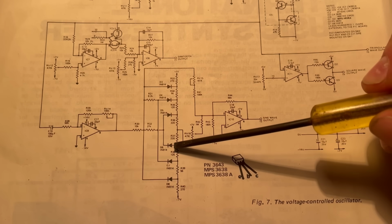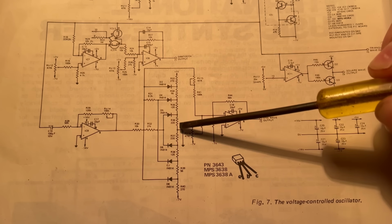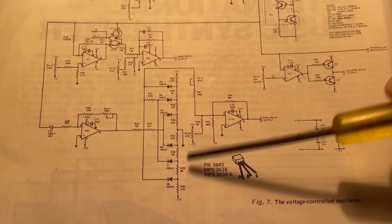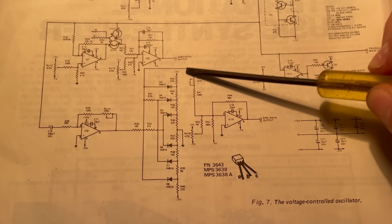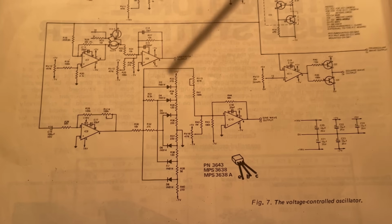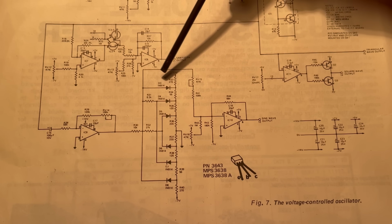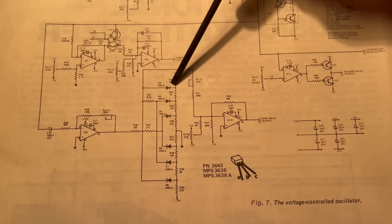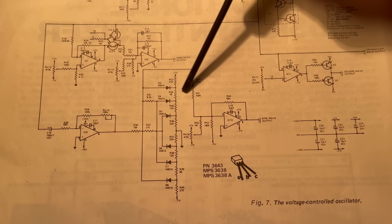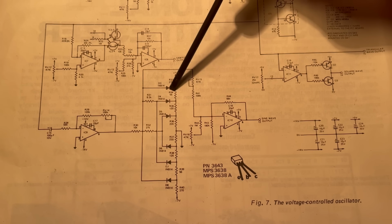So if you look at the components that are directly connected to the taps off of this voltage divider, they are diodes, and diodes only conduct current in one direction, and in the conventional model of thinking about current flow, that is conducting in the direction of the arrow, and the line there, you can imagine that stopping electrons flowing in this way.